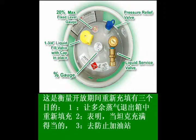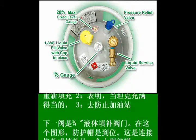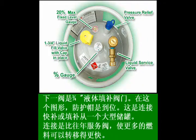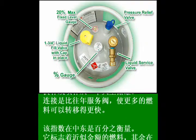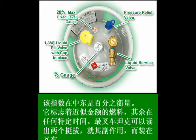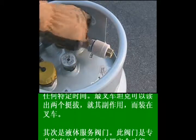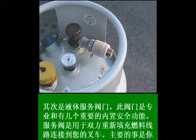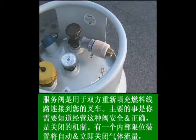The next is the liquid service valve. This valve is specialized and has several important built-in safety features. The service valve is used both for refilling and fuel line connection to your forklift. The main thing you need to know about operating this valve safely is the shutoff mechanism. There is an internal stopper device which will automatically and immediately shut off the flow of gas if there is a sudden release of pressure. When the valve is opened slowly, the fuel will flow correctly. If the valve is opened too quickly, the gas flow is automatically stopped, to prevent an uncontrolled escape of fuel if there is damage to the valve or a connection is somehow broken.